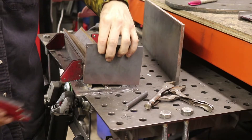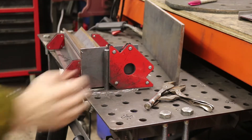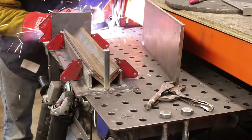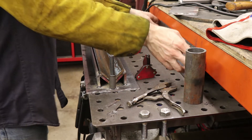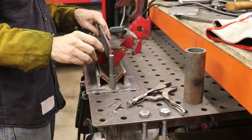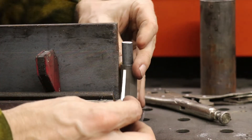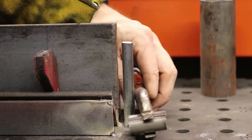In order to align the top angle iron piece and the bottom angle iron piece when this thing is functioning, I wanted to have some guide pins on the sides which the top would slide up and down on, making sure that the top aligns with the bottom at all times. To do that, I used some half-inch rod as well as some three-quarter-inch tubing. I also spaced the tubes off to the side slightly using some eighth-inch material, and later welded this all together.